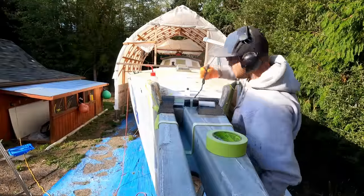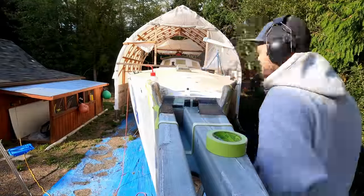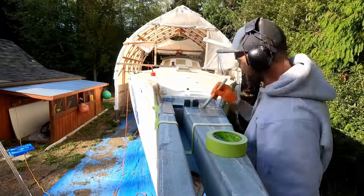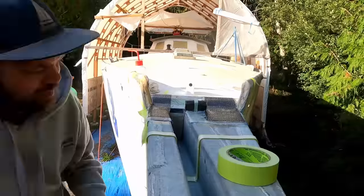Finally, I laminated the top edge to the deck with some unidirectional carbon and fiberglass biaxial. Evan recommended I do this just to help the anchoring loads a little more. Remember that this bowsprit is designed to hold 3 times the breaking strength of 7/16 chain.